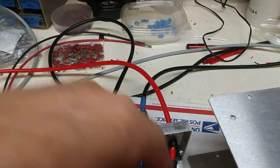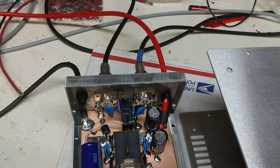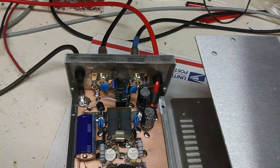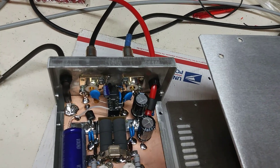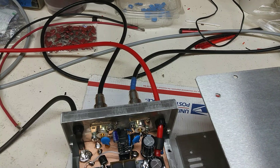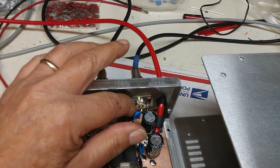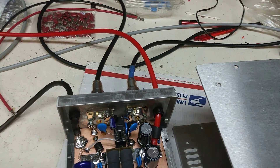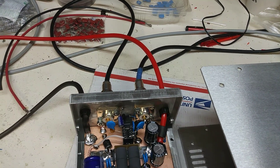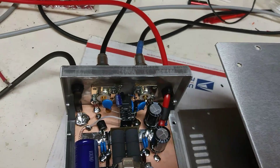It's the same turns as a regular HG — same transformer, same way I build regular HGs. T61 may make a bigger difference, I don't know — I didn't change it out. I had to really raise the output capacitance on here from a normal HG build, and this I believe is raised up really high also.